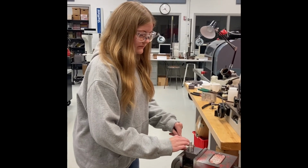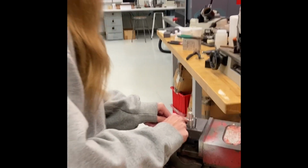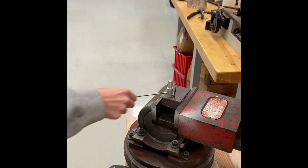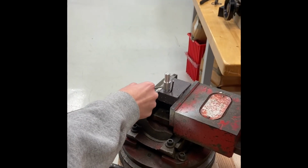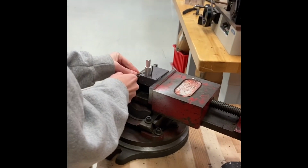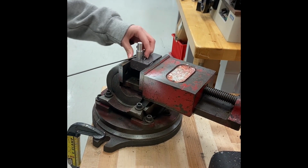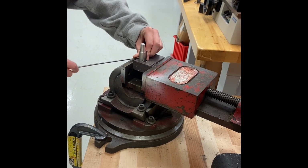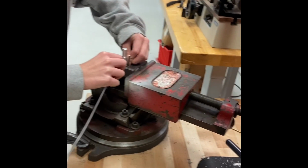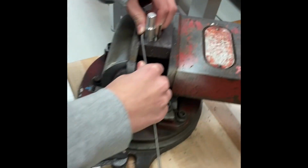That around and form it as close to the diameter of the jig there as you can. So kind of bring that around. So now remember, due to the elastic and the ductile nature of our steel, you want to bring that around a little bit more. So you might have to go on the other side of your piece of steel there. Okay, just get that back in there. There you go. Keep on forming it. Good. All right, now take it out.